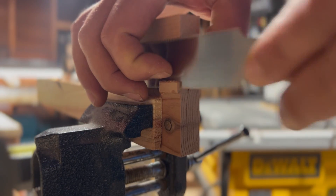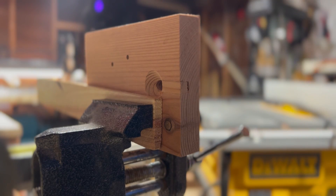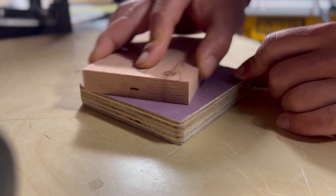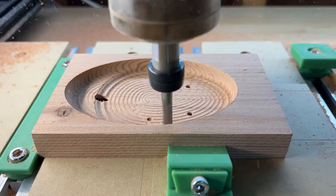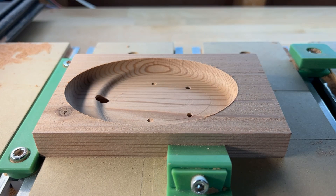But this time I was just being extra careful. The saw did a really good job, so I only need to take a little bit off with a piece of sandpaper. I put the block back in the CNC upside down and cut out the inside of the top half. It's so satisfying to see the holes show up right on target — it means the work I did to make the block flat and square has paid off.